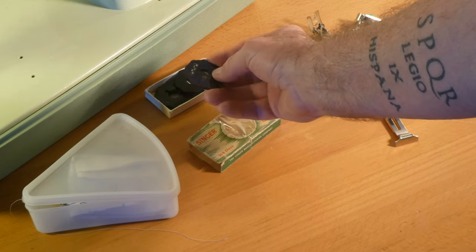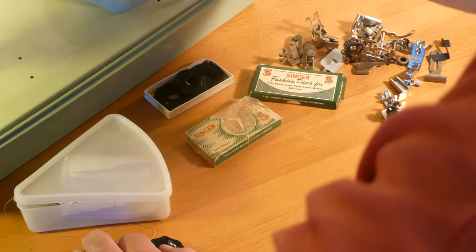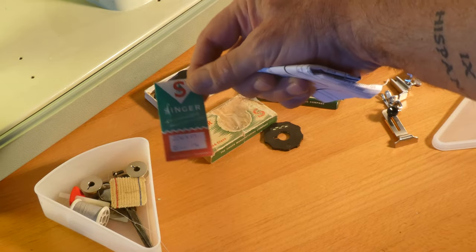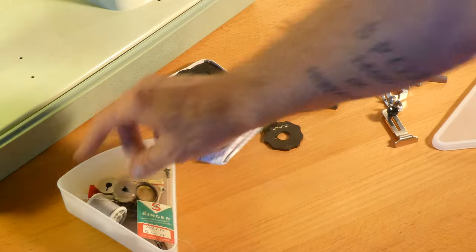There are the fashion discs — they usually have a little design on them. You can see these are 306 because they fit right on there, and there's a little stud back there. In here we have some 206 by 13 size 14 needles. And we got a couple of bobbins that this machine uses — I think those are class 66 bobbins.